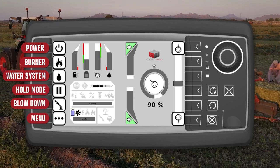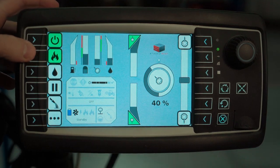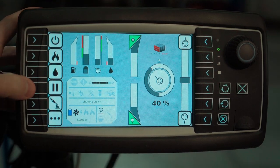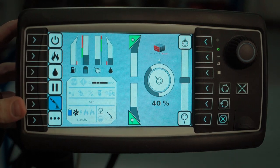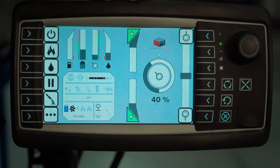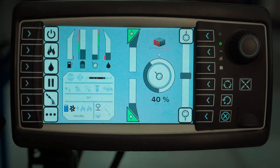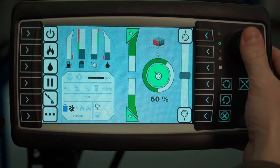The power button will turn the steamer on and off. The burner button will turn on the burner system without the water systems. The water system button turns on the water system without the burner. The hold button should be used when stopping in the field for a repair — this is not meant to be used when turning around at the end of a windrow. Press the blow down button when prompted unless you are stopped in a field. Here you are given your current levels of fuel, boiler water, steam pressure, and supply water. On the right side of the screen you control the steam distribution — you can turn on and off both the top and bottom steam valves. Green indicates they are active. The overall steam rate is controlled by the twist knob, and the steam is turned on and off by pressing the twist knob.